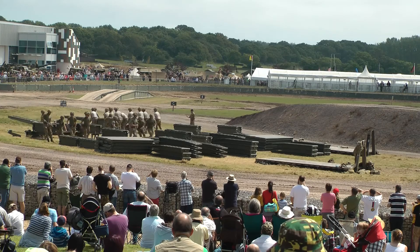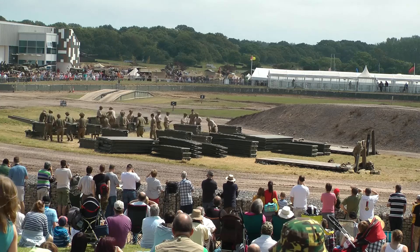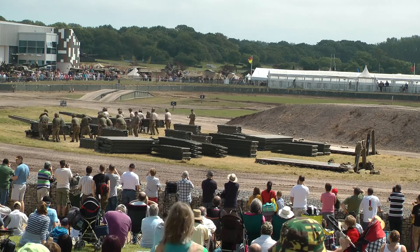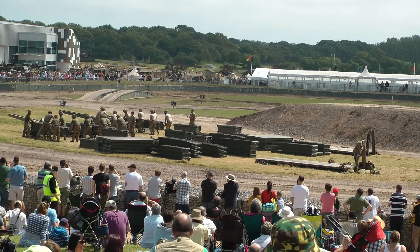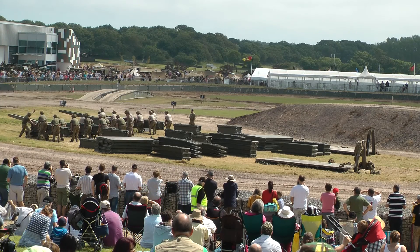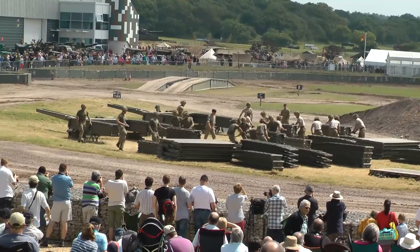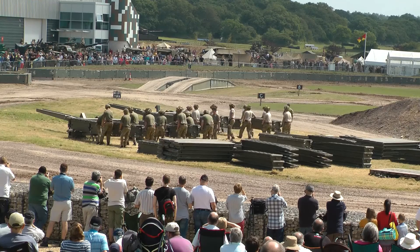I think the light guys need a bit more of a cheer from this side, please. Once they've got that first bay in, they're now moving on to create the centre sections. What they're putting on now is what's known as bays of bridge — this is a five-bay medium girder bridge. It can span up to nine metres in length, a river or a gap up to nine metres. And once it's fully built, ramped and decked, it can take a wheeled vehicle up to 130 tonnes and a tracked vehicle up to 85 tonnes. So anything the British Army's got in service now, once this is completed, will be able to drive over the top of it.